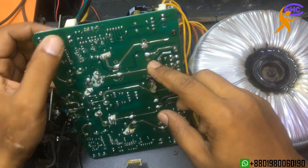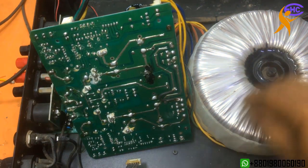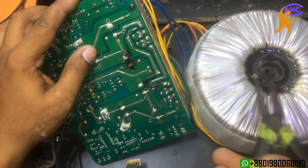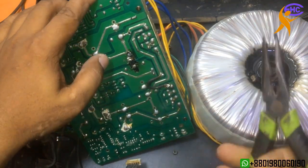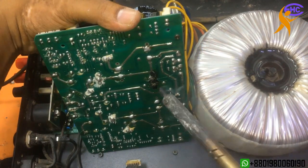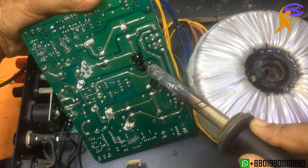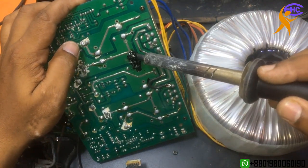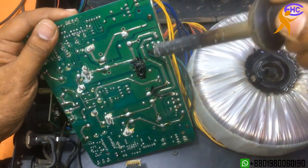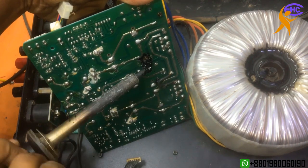The figure output got some noise. For this case I open the power capacitor circuit. Look — one capacitor has blasted, something coming out from the top. It looks like plastic or rubber. The second one, the low voltage capacitor, is well. For this case it's making noise, need to replace this capacitor. I'm trying to open it — got some plastic or rubber making a problem to take it out.